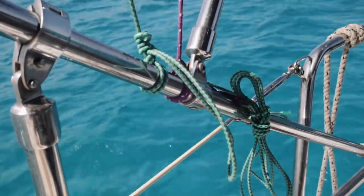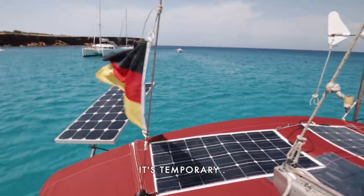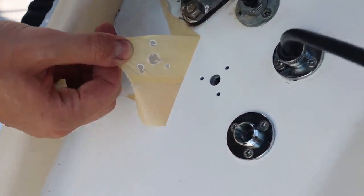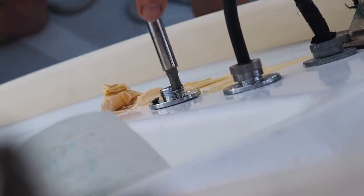You might remember from the boat tour video that we have solar panels on top of the Bimini. With the new Bimini, we had to attach the solar panels freshly and very securely with springy cords. We also had a deck shower outlet which was broken — that's where the cables for the solar came out last season, a dirty fix because the cable didn't fit through it. We had to drill through the boat and put new deck fittings. Of course I didn't look up how to do it first and I cracked the gel coat. Then I found a way on YouTube and the second and third deck fittings went really easy and looked amazing. Newly acquired skills.